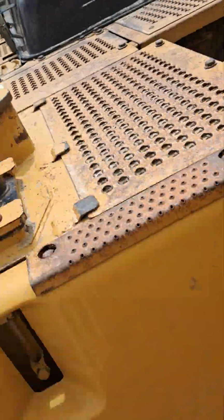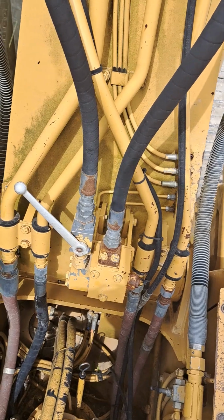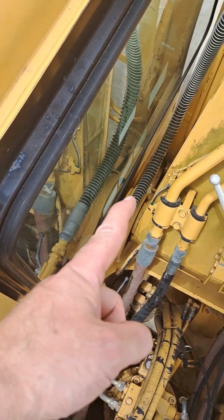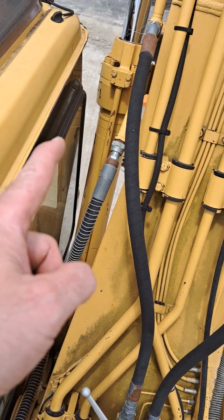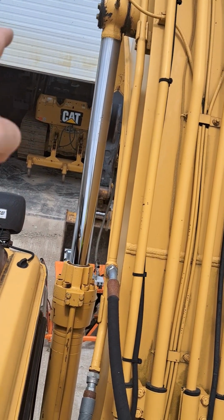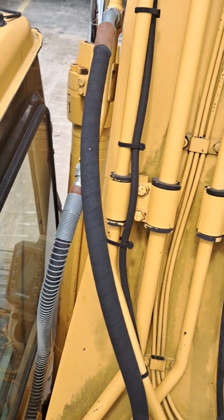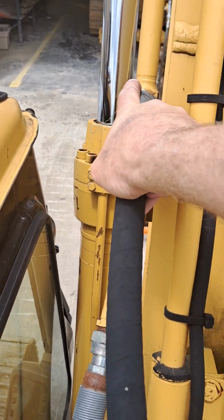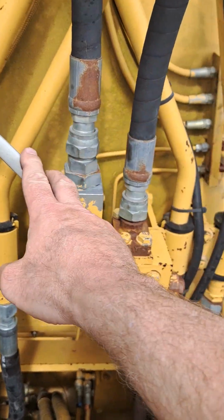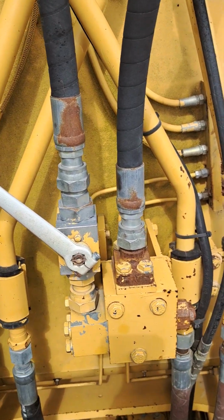Boom. Also to do mainly with single acting attachments. So this is the supply line here for the auxiliaries. That's the attachment line going up and feeding. So in single acting, we're feeding to the left side of the quick connectors on this machine, and then teeing off of that pipe on the supply side for single acting. This hose runs to this ball valve, which is currently closed. See the line this way, indicating the oil flow is blocked.